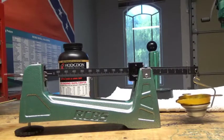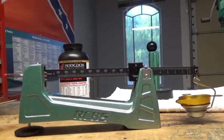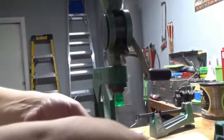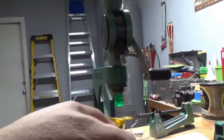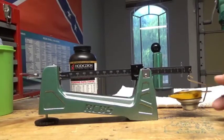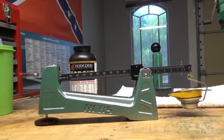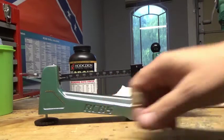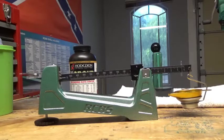We can see we're a little bit high, so we need to adjust down. Coming back to the powder measure, I'll turn the plunger in just a little bit since we were running high — don't need to do much. We normalize again: first charge dump back, second charge dump back, then weigh the third charge. Now we're a little bit low, so I'll turn it out a little bit to see if we can get it dialed in.